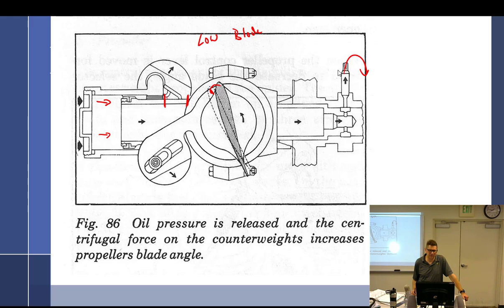And what had happened, the guy said he was flying it along and he heard this bang, and he goes, I swear I saw the prop stop and go. And it cracked the nose case and it cracked part of the power case section. And so he brought it to our shop and the boss was like, yeah, we can have this fixed. And so I took it apart. He sent it out. He had it weld repaired and brought it back and we put it together. And I think the metal was just too fatigued at that point. Probably shouldn't have done it.